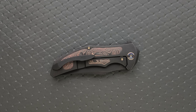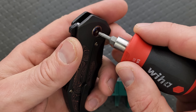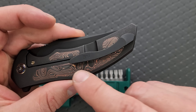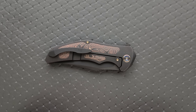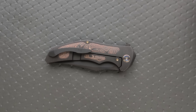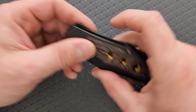Let's go ahead and do a hardware check. My tools are very inexpensive and very recommendable — you can find them right down in the description under the tools I use on this channel. This is a T8, and like other WeKnives, everything's going to be T8. Two screws on this side, a screw right here, and a hidden screw for the pocket clip. There's also the lock bar insert screw, but you're never going to have to take that out. Anybody who does take those out — stop doing that. Leave the lock bar insert alone; you don't need to take that thing out and clean it. Minimal hardware and T8.